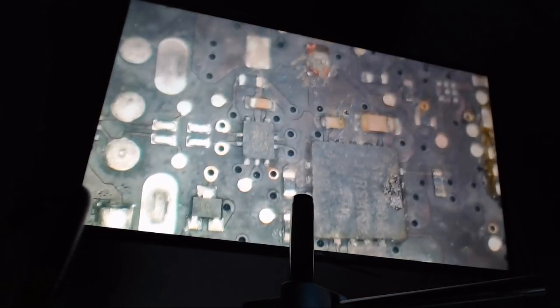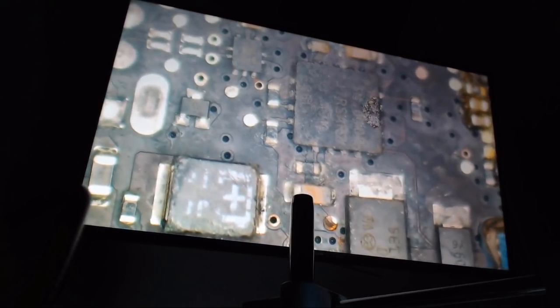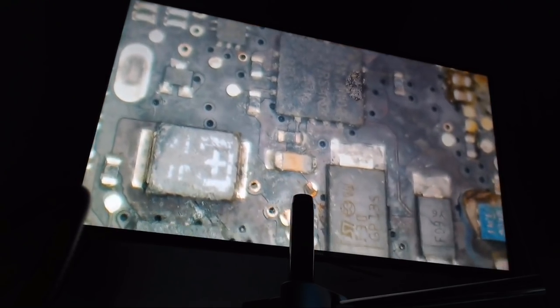And looking at the Crest cleaner, however, it's still left on corrosion. Now, keep in mind this board was pretty nasty. You saw the before. This is flux. This is a donor board. We just injected voltage on Thunderbolt. Let's see, here's the other Thunderbolt circuit. It cleaned up a bunch more off of here, but it still left some. This isn't bad. This is pretty clean. However, it still left on more than the SharperTek did.